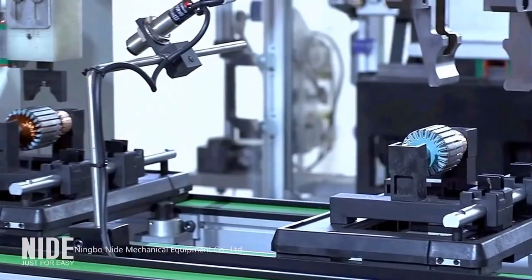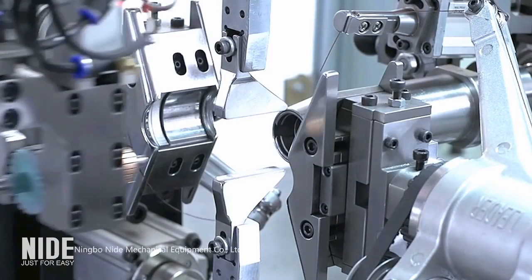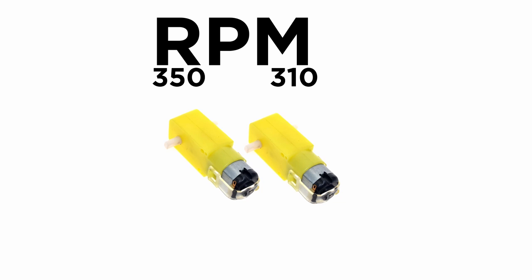The last thing on our list, but possibly the most important yet, is synchronizing the motors. Due to small manufacturing imperfections, identical motors might have slightly different velocities. One possible reason is that the wire making up the windings may have slightly different diameters and therefore different impedance; this can also be caused by the magnets, the brushes, or all of the above. You should always test both motors side by side, and if one is a little slower you may want to multiply its input inside the Arduino sketch by a greater-than-one factor so both motors have the same RPM when the same voltage is applied.